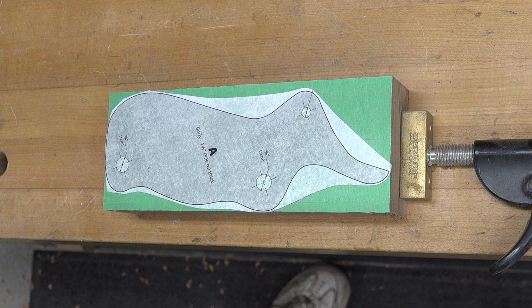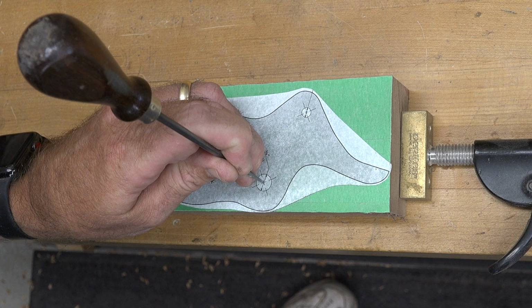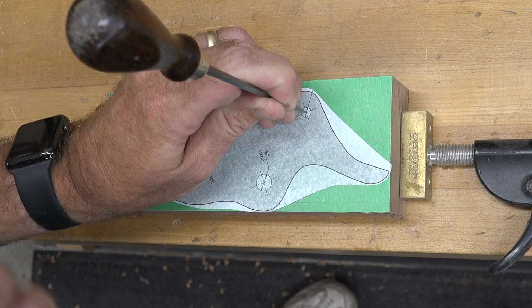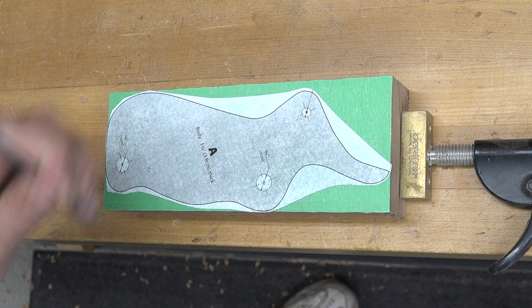First things first, guys, whether you're building a toy or whether you're building fine furniture, accuracy is important, and it's good to keep those practices in mind as you go. So before you drill any hole, you want to center punch it. Also, when working with wood, while twist bits are cute and everything, they're more for metal working. So you really want to get yourself some brad point bits. You'll find your accuracy is much better.